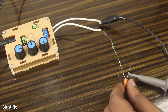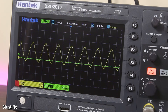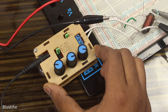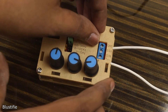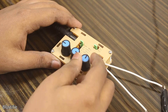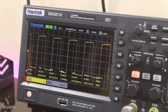I noticed there is around 6V of DC offset present on the output of the signal generator, which can be filtered out with a simple setup. But sometimes instead of wiping it out completely, it could be better if we can adjust the offset according to our needs — that's the topic of another video. There is a hassle though: when you need to generate any kind of signal, you always have to attach a scope to visualise the frequency, unlike the expensive ones that always have a display. You can switch between sine and triangle wave using one jumper, while the other jumper sets the frequency range. These knobs set the frequency within that range, and one knob is for amplitude adjustment.